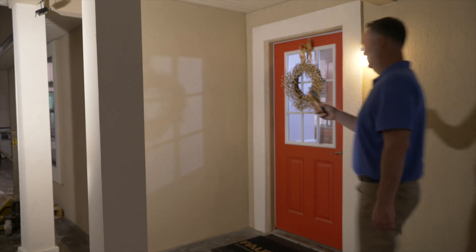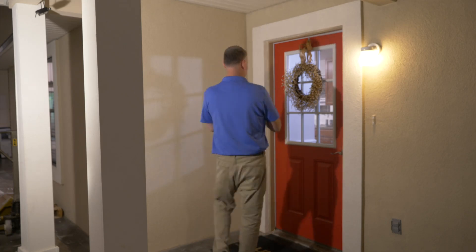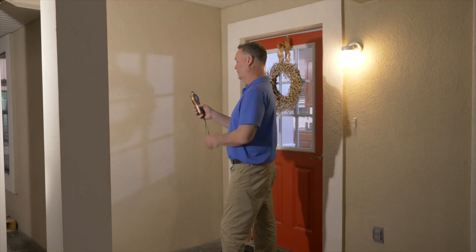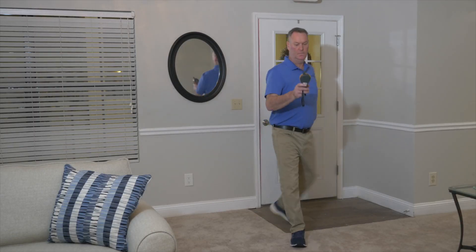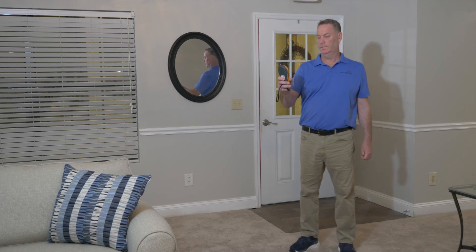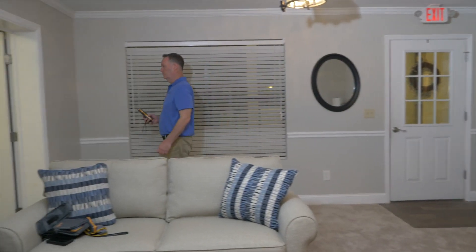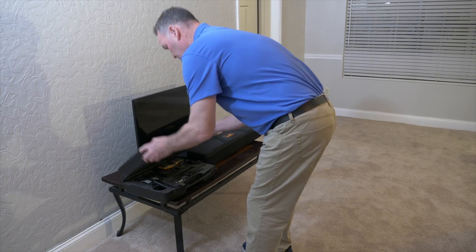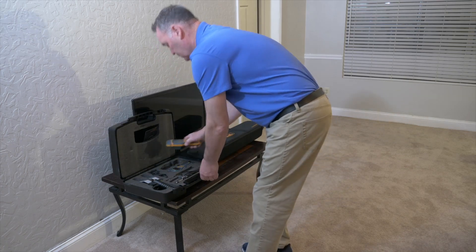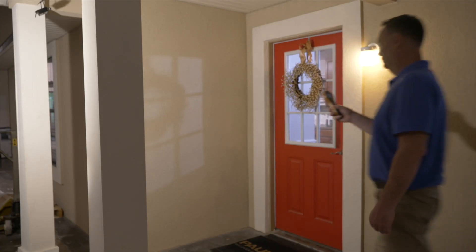During our initial flood assessment it's also important to take humidity readings — outside the building, in the affected area, and in the unaffected area. Record relative humidity, temperature, and grains per pound, along with the time and date. Think carefully about acclimation: this is where most false readings come from. Hygrometers take time to adjust to temperature, so store the instrument somewhere that's not an extreme temperature, like a hot or cold car, to help it acclimate much faster.